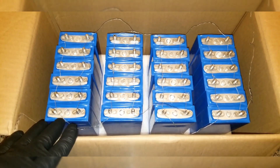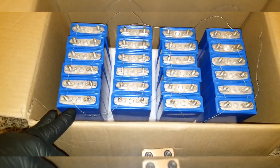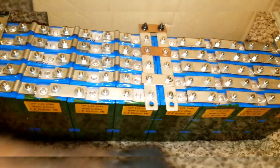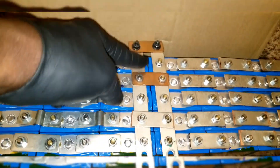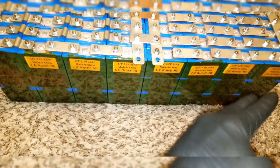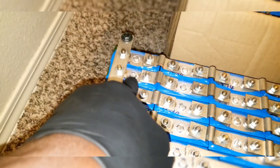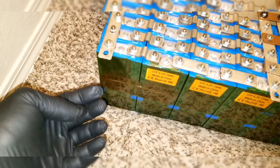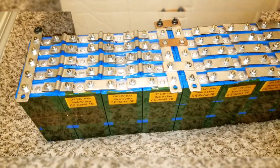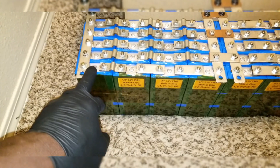I think it was not a total waste — I just have to reconfigure, maybe add more batteries here to get another string. I'll extend them, pull this one forward, move this to the next notch, take two more batteries and hook them up to continue the string so I can have sixes — one, two, three, four, five, six — six batteries in parallel or series, whatever I want to do. But I have to be careful with my configuration because I already have it set for a 12-volt system.